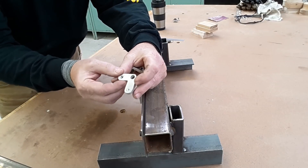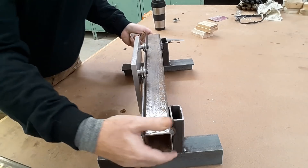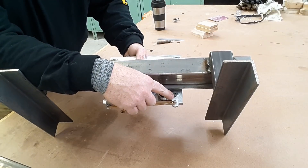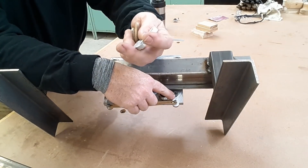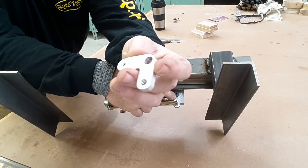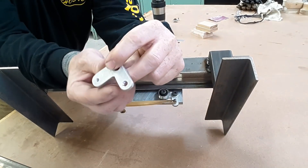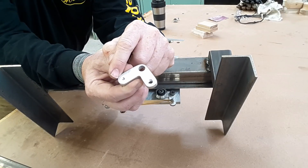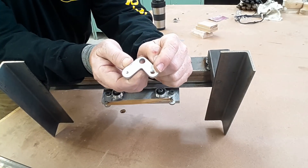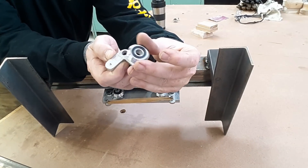These control horns are held onto the plate with a shoulder bolt, and that's what it pivots off of. It's just a piece of quarter inch aluminum with three holes drilled in it. This is where it pivots, here in the middle. The little one here is just for a screw that the spring — or in this case the rubber bands — are held onto. And then this larger one over here is for a second shoulder bolt that the bearing rides on.